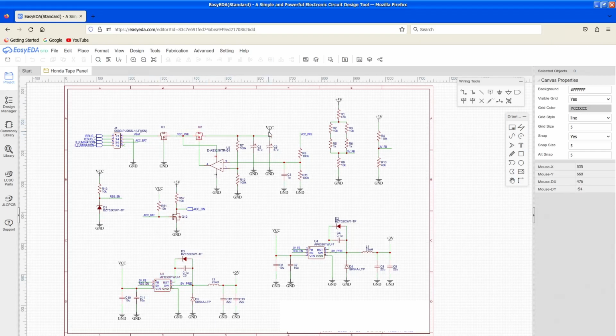What this does, it essentially ramps up the voltage input at these voltage regulators to whatever the battery voltage is. The voltage regulators themselves are AP63301 switching voltage regulators. I've had very good luck with these. They're very efficient, holy crap. And the switching speed is fast enough that I don't need anything super large. 22 microhenries and 44 microfarads is nothing. Hell, you could probably fit this on a breadboard the size of a thumbnail if you had to. But there's two of them, like I said. One of them is for 5 volts for the Arduino, or the chip, the microcontroller that will be programmed by the Arduino, and all of the other communication stuff, and 3 volts for the LCD.